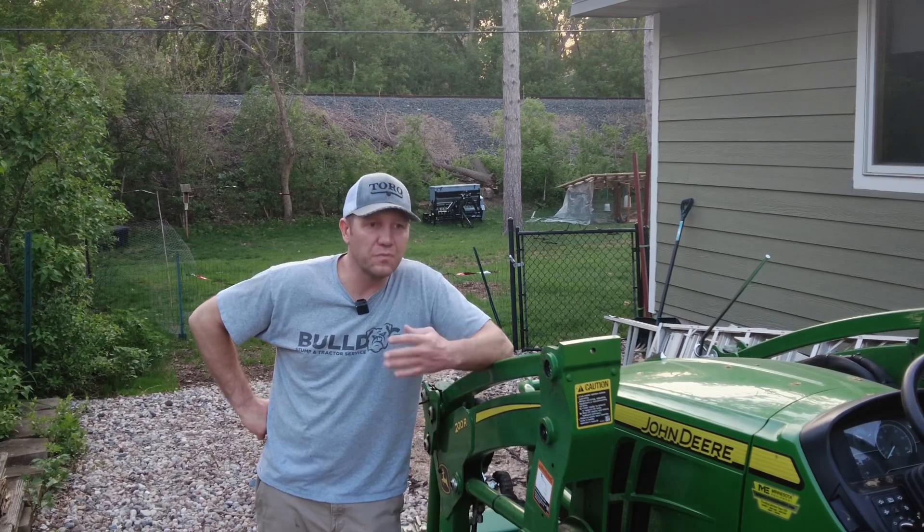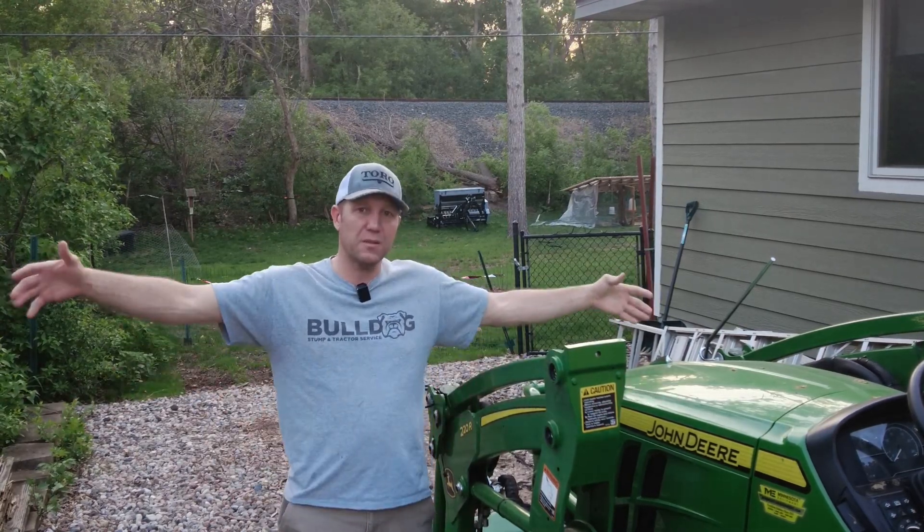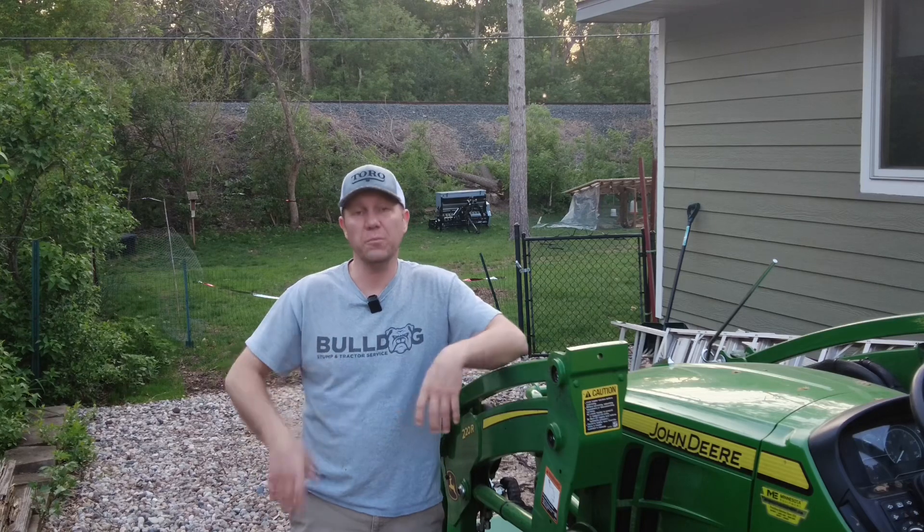In the bigger video you'll see me hitting a pine tree and multiple other stumps. That is stump removal — it's not conventional, may look a little different. All the roots around it we blew up with the stump grinder, ground out all those with the stump grinder all the way around it, then drove straight through it and popped out some other roots on the side as well — big roots too. Then I came under it after I got the taproot, another nine inches below grade, so now we're over a foot below grade and the stump is gone.